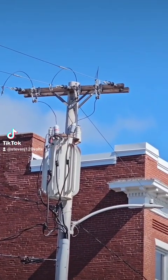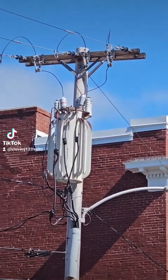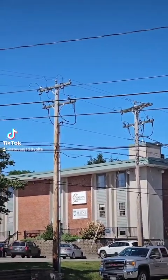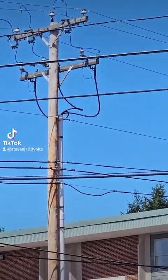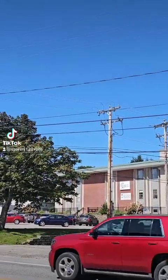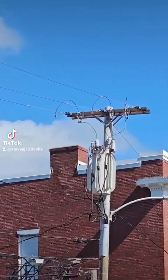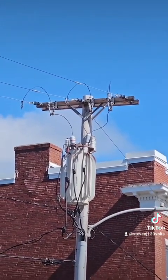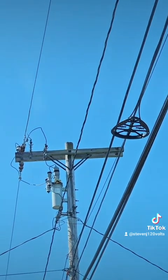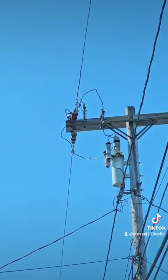That is a three-phase transformer. Can you see how they tapped off each phase — a tap down to the transformer? So that's three-phase power. Over here, this is to the fire department. They brought the phases, the primaries, underground. So there's a transformer somewhere over in that facility set on the ground on a pedestal or something like that, but that would be three-phase going off into that building as well. Three-phase power: one, two, three phases tapped. When only one phase is tapped, it's single-phase.